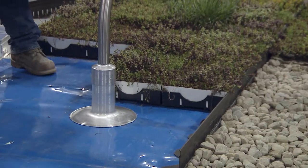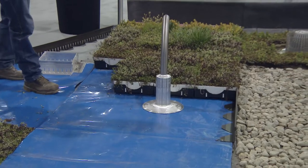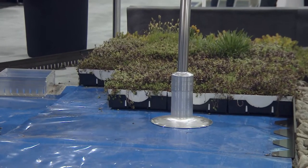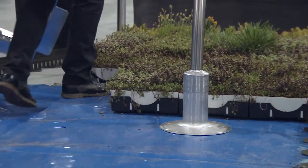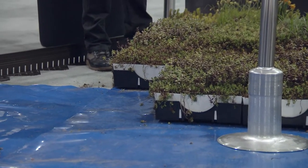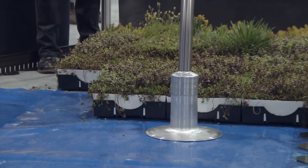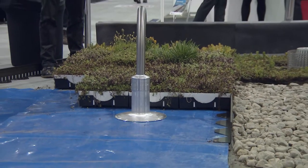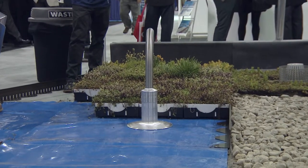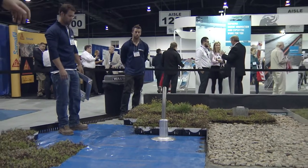The second step is to lay out the vegetation-free zone. There's a continuous vegetation-free zone in the green roof system — a requirement under the green roof construction standard in Toronto, and required by almost every roofing and vegetated roof manufacturer. Its primary function is as a fire break between the green roof and any combustible materials. A secondary function is as emergency overflow during exceptionally severe storms, and it can also be used to hide irrigation pipes.